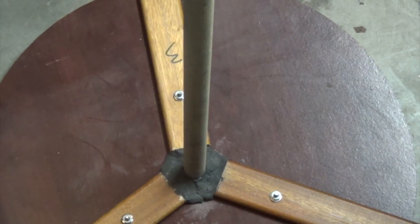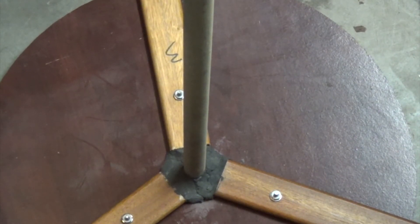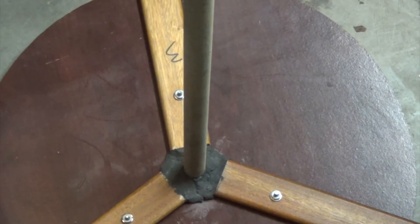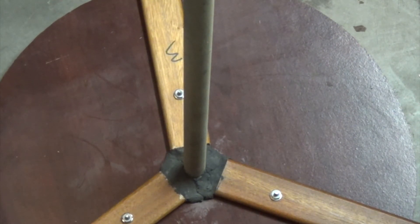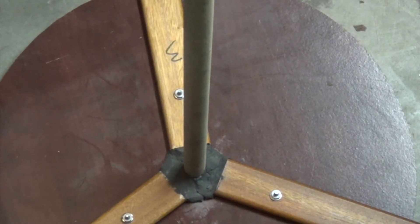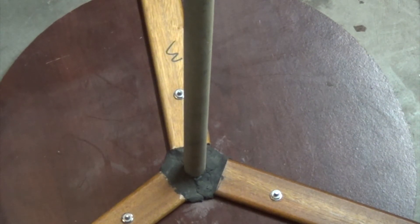What we're looking at right now is the top of the windmill. I didn't drill a hole there, so in order to get this conduit in place and make it stay, I put the EMT down — it's about five feet long — going down resting on the top. This thing's flipped over at the moment. I put it in place as centered as I could get it, then took some steel stick JB Weld, mixed it up, and put it down in place around it here.